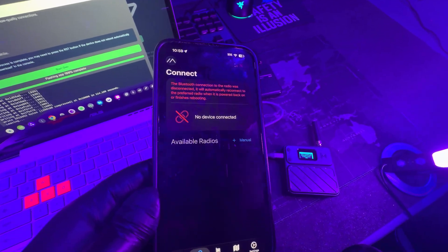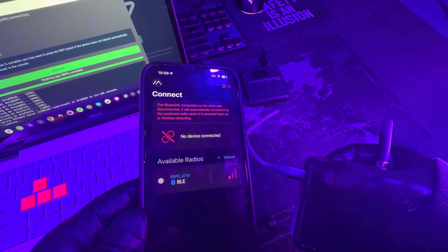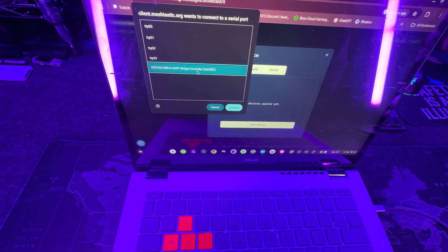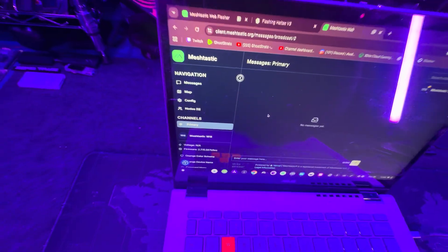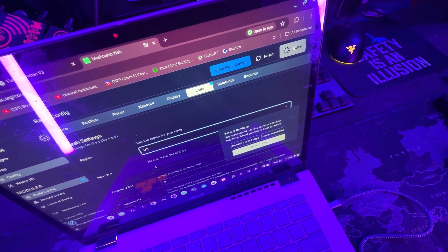Now I'm going to show you the web version way using your computer. I have two N32 Pluses that were sent to me, so I already flashed Meshtastic on this one — I'm going to be using the web client, which is just a website you go to. I'll leave that link in the description. Once you're on the web client, click on new connection, then click on serial. It recognizes the plugged-in device as serial. Connect to your device just like you did with the web flasher, click on it, and you'll see all the options pop up. Navigate over to the config section, then move to the LoRa tab. You'll see something that says unset — select your correct region, hit save in the top right corner, and your device will reboot and be ready to go.